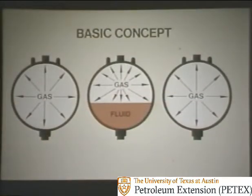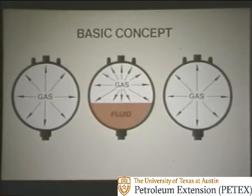The basic concept of an accumulator is that nitrogen pressure — gas pressure — is built up in a tank or chamber. The hydraulic fluid is forced into this same chamber, increasing the pressure. Then, when the hydraulic fluid is needed to operate the rams, a valve is opened and compressed nitrogen forces the hydraulic fluid out. This basic system needs some refinement: there needs to be a stopping device to shut off the nitrogen to keep it from following the fluid into the lines, and working pressures need to be established.